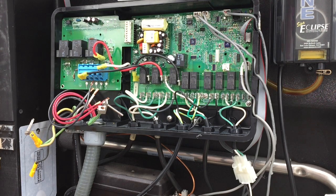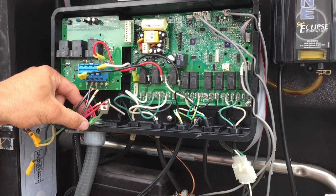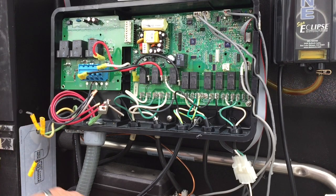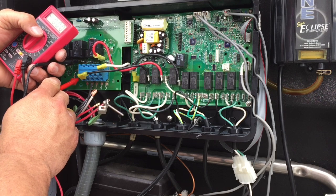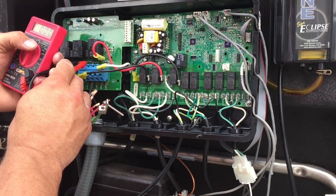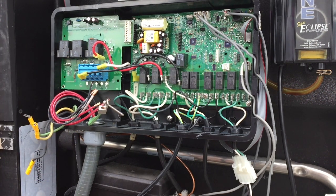Okay, so it's Monday and the new board has arrived. Here's the new one, here's the old one. I've already removed the feed for the main 240-volt lines right here, and I've removed the leads for the heater down below. With my voltmeter, I was only getting from the ground to one lead for the heater — nothing. The other lead to the heater was 110 volts. Testing both leads together was zero, and this should be 240 volts between these two contacts. That tells me this is, more than likely, a bad board.